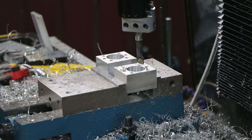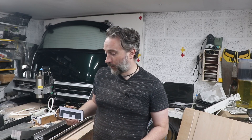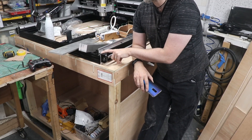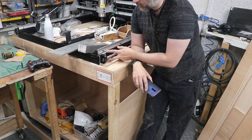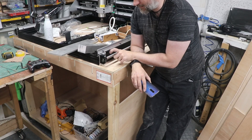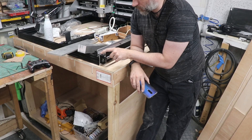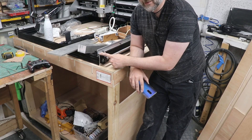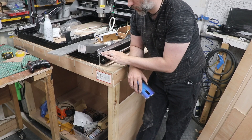A lot of just getting machined flat surfaces, two dimensions, drill a few holes. I made a few screw-ups - at least one of the front brackets I drilled the wrong dimensions off the edges, just read the numbers the long way around. Fortunately I had enough material to flip it over, make the correct dimensions, and avoid the extra wrong holes. So the front plate goes on here. Because we're using this 80-20, it's quite useful for reference surfaces. I know that this needed to be exactly 80 high and where these slots lie, and I could make sure the mounting holes for this BF-12 bearing bracket came flush with this top surface, so I always have good known distances both up and out from my reference positions.